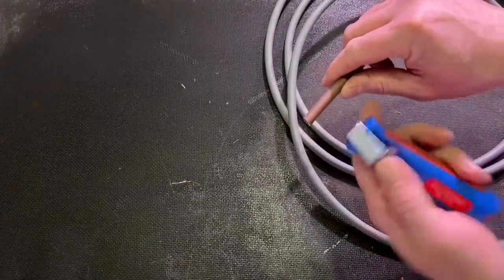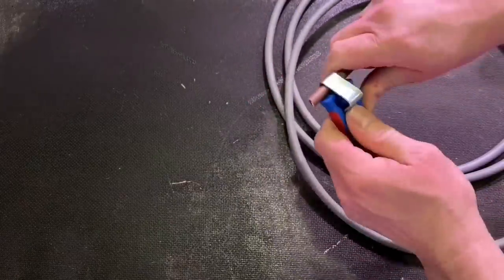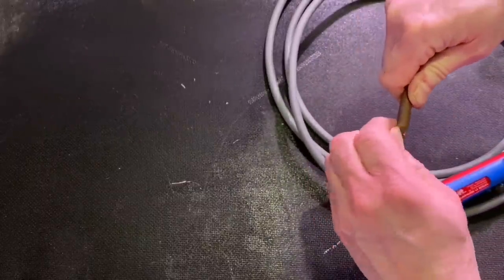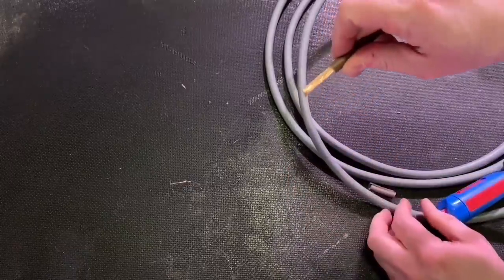Let's do the inner — removing the brown now. In we go, push down, round, pop it off. Go easy, that peels away. Just get it on the end again and then that should come off nice and simply. So there's our 19 cores — flexible tails.